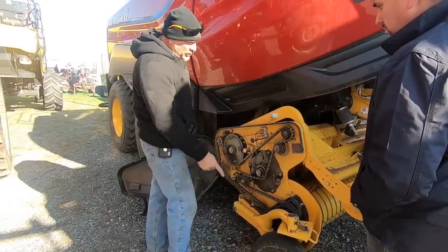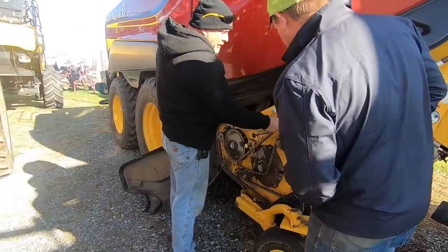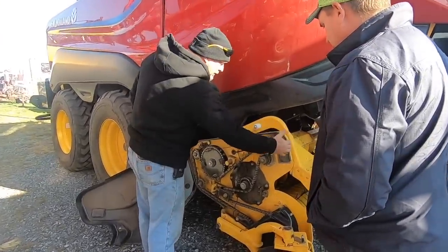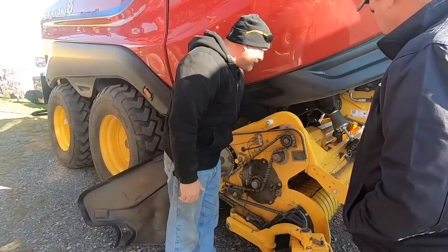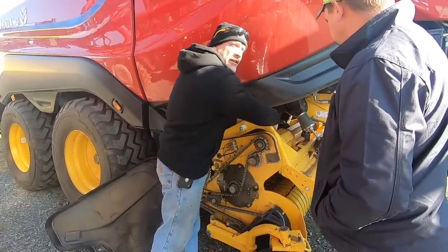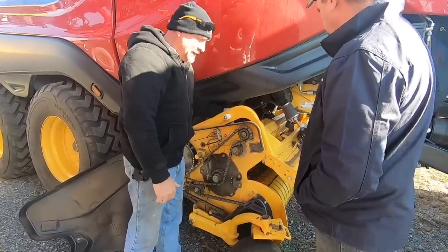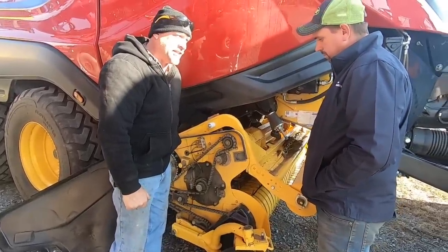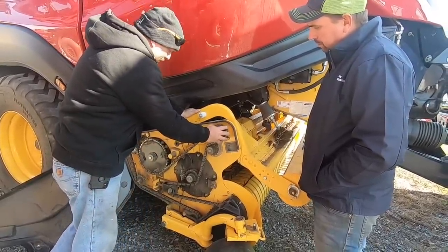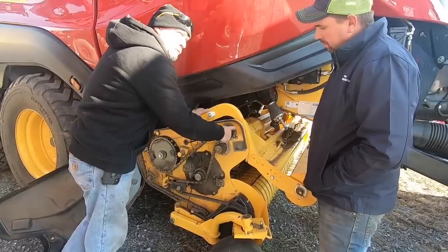This is the way it goes on. This was the biggest problem that we had. It would pull on this. I had these bent. I welded parts there. I took the shield off, which is a stiffener for this whole bracket here. I took that off and I welded a 5/16 inch thick piece of steel onto that, and I stopped it from doing what it was doing, which was just because it's pulling on this idler sprocket.